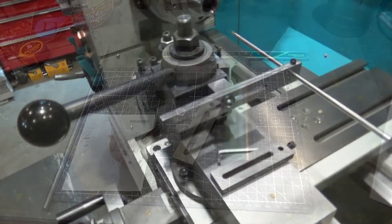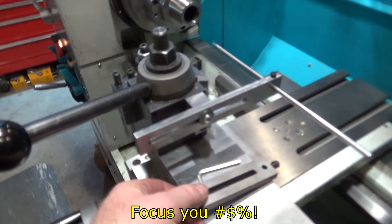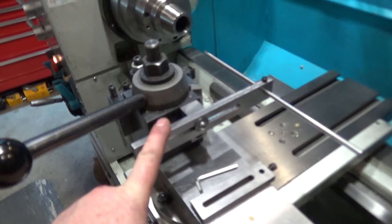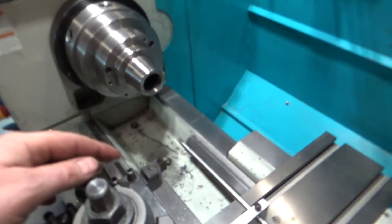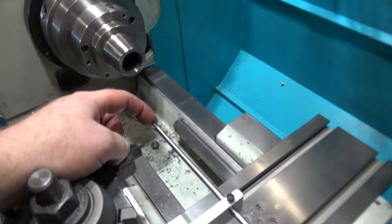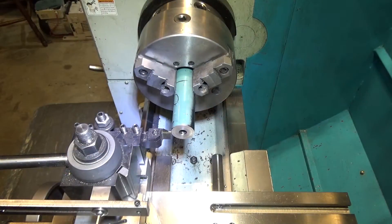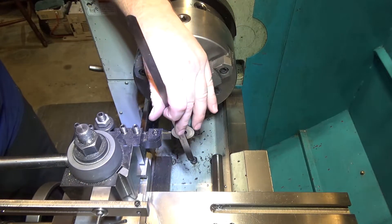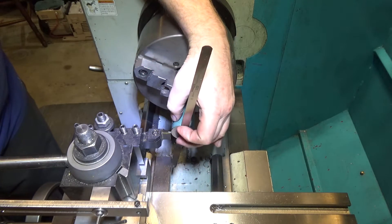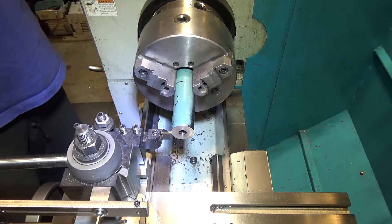I was so excited to use the piece I already had because it seemed the right size — but it really wasn't. I had to make one about twice as long to get enough range, because ultimately you need the parting tool off the work with the probe just touching the work, and when the parting tool comes in to cut, the probe is no longer touching. For setting up repeat cuts, Joe Pisinski's solution was to use a straight edge — I'm using a piece of feeler gauge, 21 thousandths, which is pretty thick.